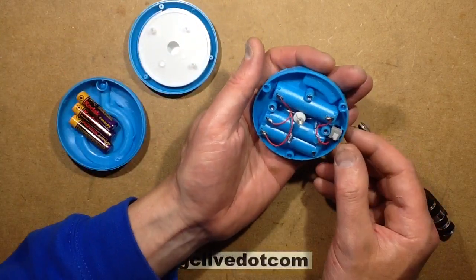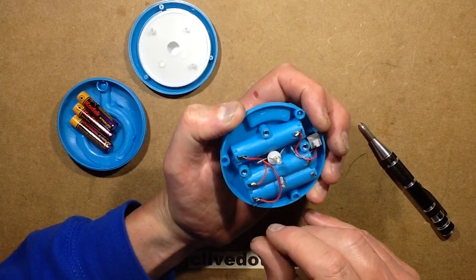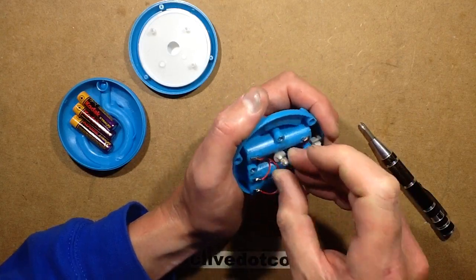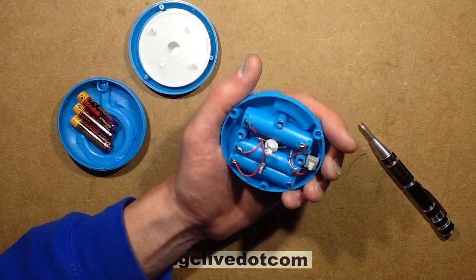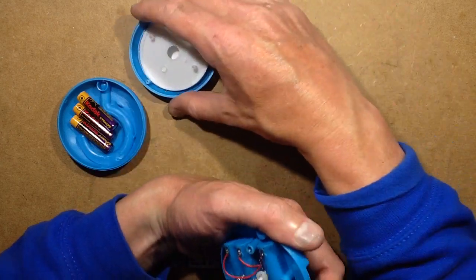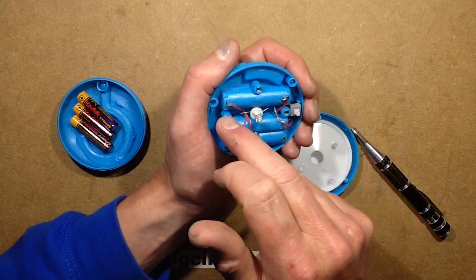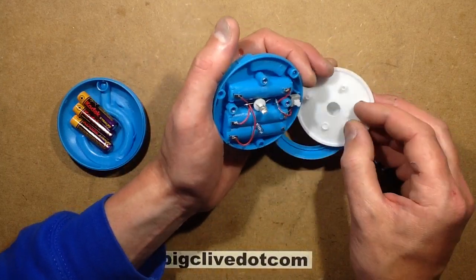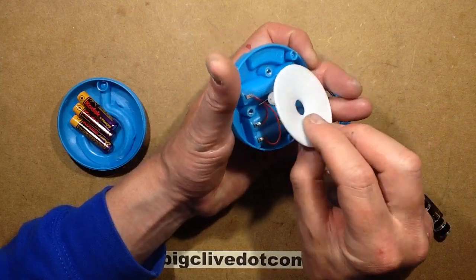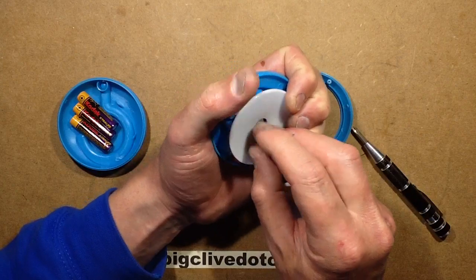The switch is actually mounted at the side, and it's got a resistor in series with it. The LED is just on a little plastic press-in stand. There's one protruding spring sitting on top of the battery pack, and the other ones are recessed with pins that align it. There's also a sort of reflector so that any light coming out sideways is optimized. It's quite a nice design actually — quite attractive.